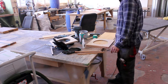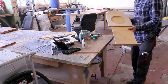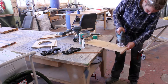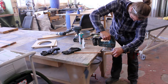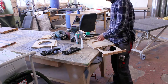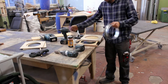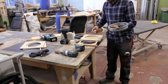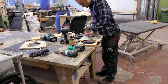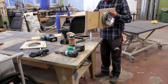Here I'm just figuring out how long I need to make my blast gate. I cut it to the final length and cut the hole. You might think it's rather flimsy — and it actually was — but later in the video I added some extra support so they came out really strong. I attached these fittings with the same CA glue. I just used plenty of it and it worked just fine.